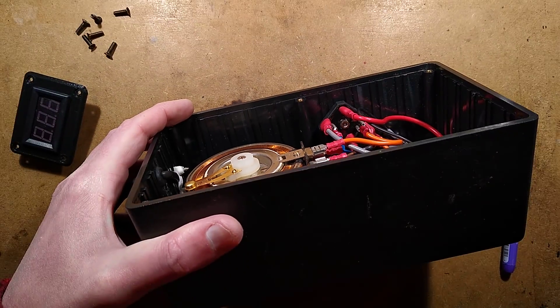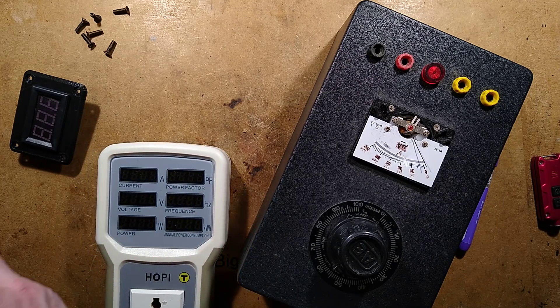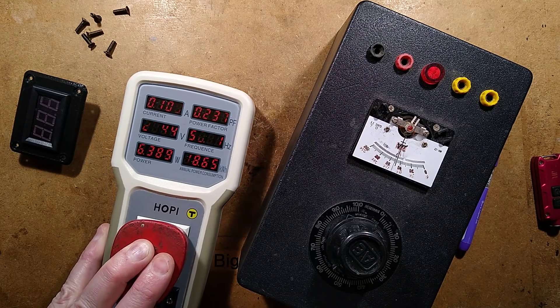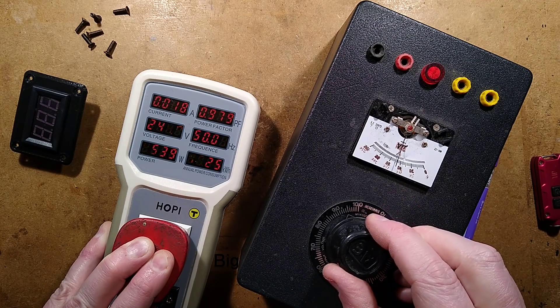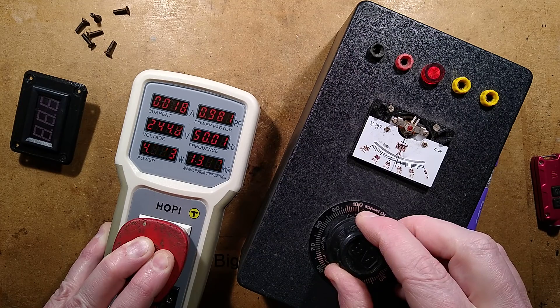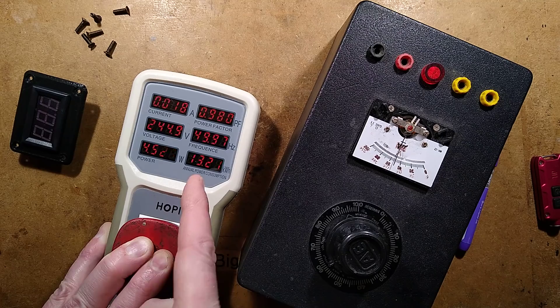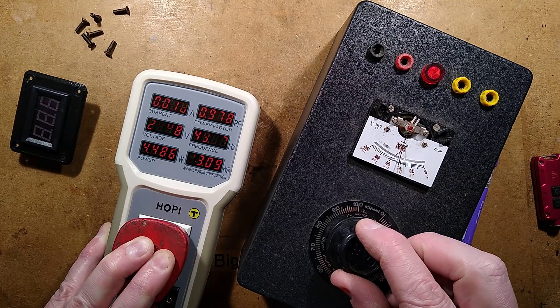Let's stick it on the power meter and see what the losses are with all those shorted turns. I'm going to plug this in with its fetching red MK plug. When I plug it in, the losses are about 4.7 watts. As I vary this, the needle is moving a little bit, and the losses fluctuate up and down as it passes windings and different windings get bridged together. But the losses really aren't that significant — it's quite impressive. The power factor, partly because it's not loaded, is 0.98, which is really very good. And it shows a current of 18 milliamps is passing, which isn't that much at all.